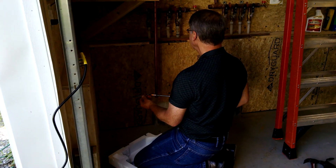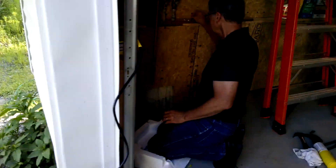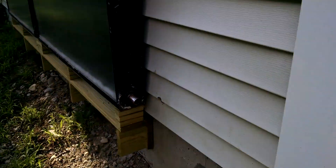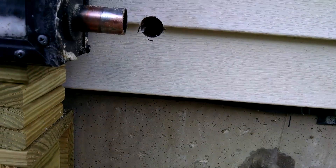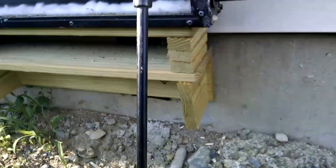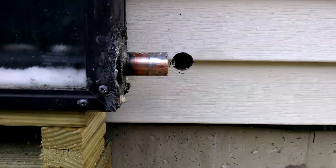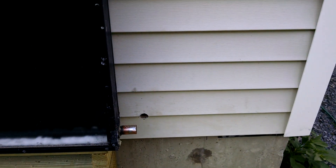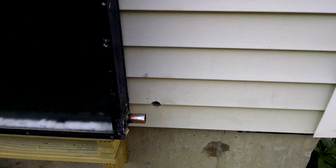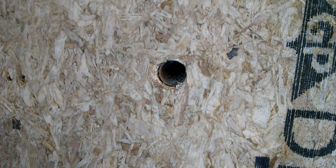Reinforcements have arrived. We are taking off this panel — as we were drilling this hole, the bit came off the end of the extension. So I've got my drill with a nice long extension and the bit came off inside there. Now we're taking the panel off and we'll have to go from the other side. I was hoping just to go all the way through in one pass, but oh well. We put the panel back, finished drilling after we got that bit out of the wall cavity, and now we have a nice hole all the way through.